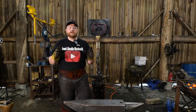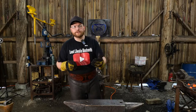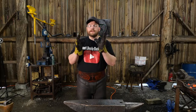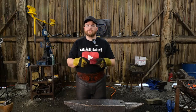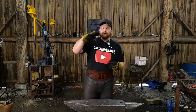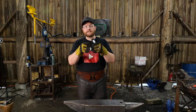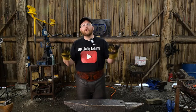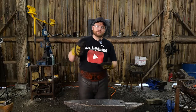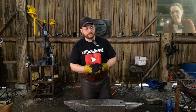So miniature anvils are really fun to make out of bolts. If you can get grade 8 bolts or at least grade 5 or better, you can make really nice little stake anvils, mushroom stakes, things like that. And the nice thing about it is that you have a head already. You've got an upset mass that's very easy to translate out into horns, or forge it out one direction if you're needing something like a scroll starter. It's a nice starting point, so to speak.